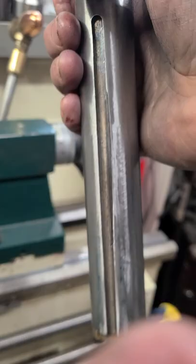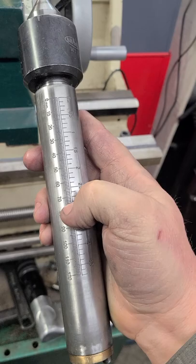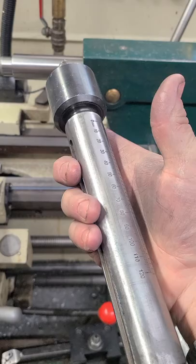So this piece here, as you can see, when you go to use bigger bits, it's soft. This has the little lock here, or the key way that keeps this whole thing from turning. Well, when you'd use bigger bits or whatever, you can see it would swage this edge over, and it would stand up. So I'm not too concerned about having graduations on a tail stock.